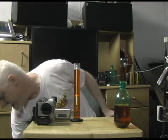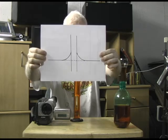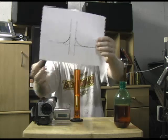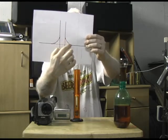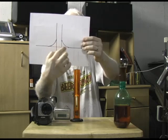But there are other things that are more concerning than that, because that's minor. The one important thing when using your hydrometer is where you read it. Water has a tendency to climb up on the sides of things — so with a hydrometer you kind of end up with a meniscus. Where do you read it — up at the top of the curve, or down at the base? You need to be reading it at the bottom — the base of that little phenomenon — always. I learned that in science class back in high school.